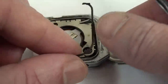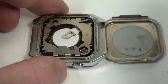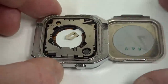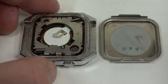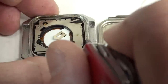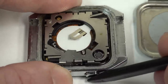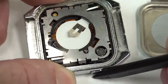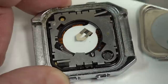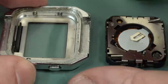Is that a really crapped out O-ring? I think it might be — god, it's almost turned to plastic. Not sure what the deal is there. Not too impressed by that. That's classic watch construction. Of course there's our piezo transducer on the back. So the plastic retaining clip just keeps in the rest of the mechanism. We'll lift that out. We've got another ring. And the thing about the metal back in here is they actually use that so when you push the button, the little contact in there pushes the metal against two contacts on the edge of the PCB. The module's gonna pop out — we've got our little trimmer down there and a little reset. And there we have it, the module comes out — ta-da!